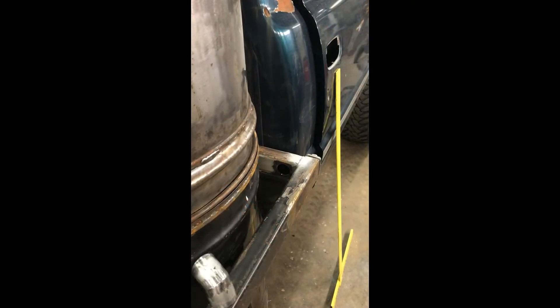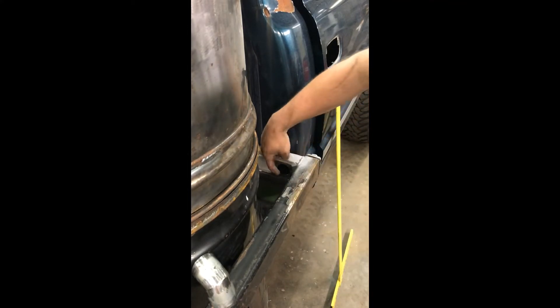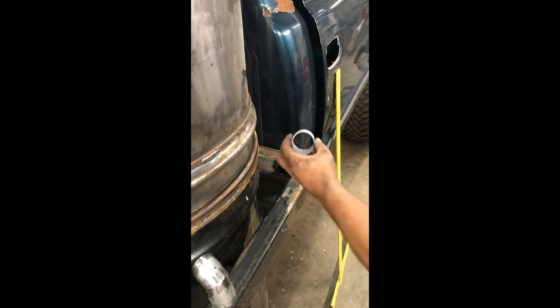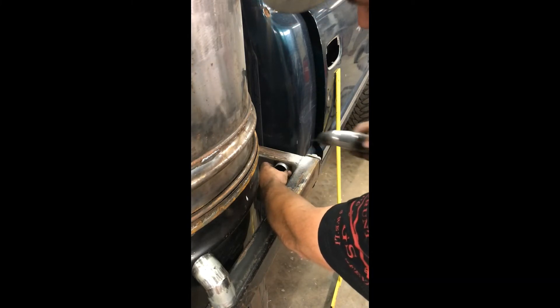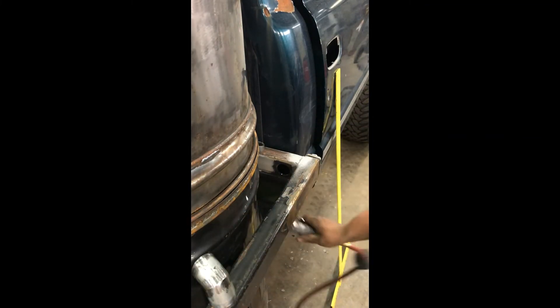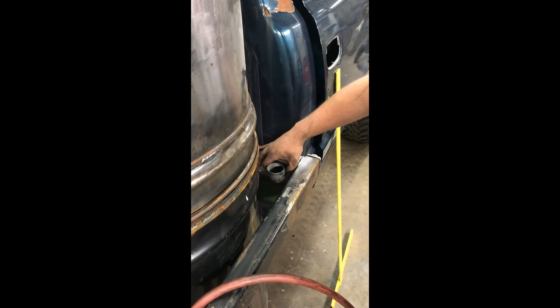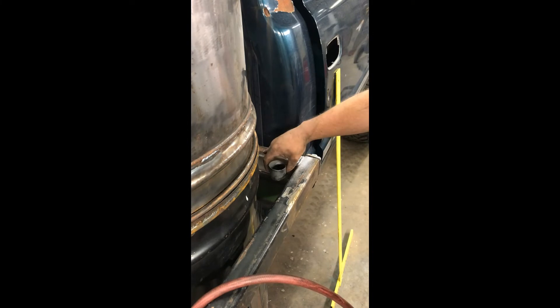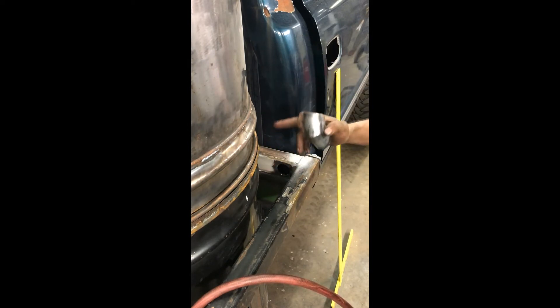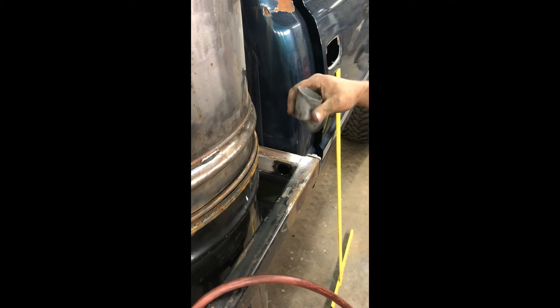With the hole marked, I came in with the shortest drill bit and a 90-degree drill I could find. I popped the hole top and bottom just inside of my line. I took a little short piece of the pipe — the diameter I'm using — set it on there, traced out the inside radius, burned the hole out with a plasma cutter, then came back behind it with a flap wheel on a die grinder, opened it up to the right diameter, made a nice smooth transition, and got all the edges cleaned up. This guy is ready to go in place. The only problem is if I weld this in right now it would make building the rest of the stand pipe a real chore. So this is going to get tacked in place, and then I'm going to build the stand pipe and both the standoffs that go into the hopper gutters all at once. Then I will cut my tack welds, pull it out, fully weld both of the standoffs, then weld this in place.